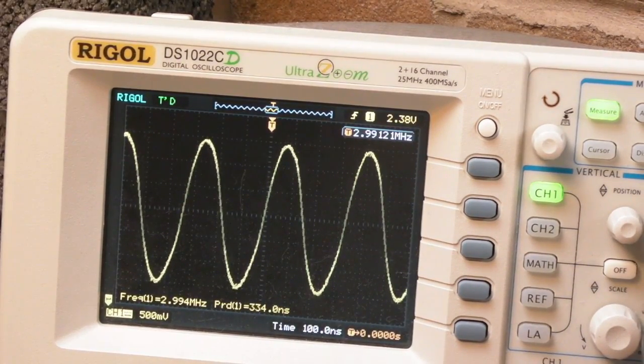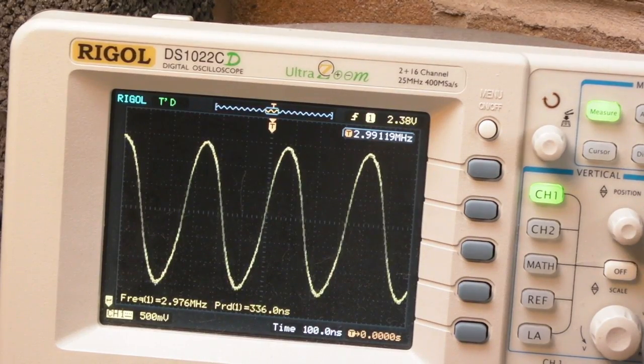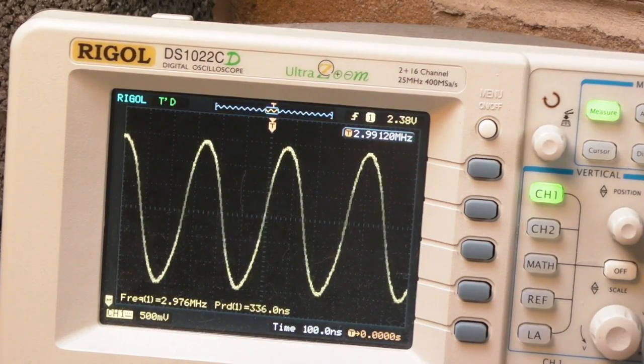And if I'd been scoping it and testing the keyboard at the same time, it probably would have found that actually the caps lock worked and the keys would have worked, etc. And this is the thing, if you scope things and you've not got a really high impedance on your probe, you can actually resolve the problem. And that would have been a clue.